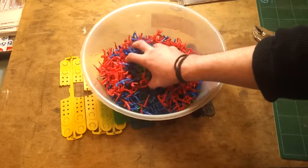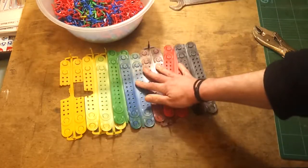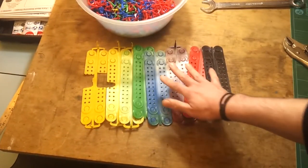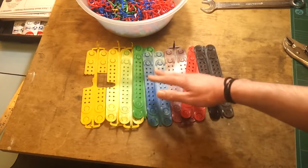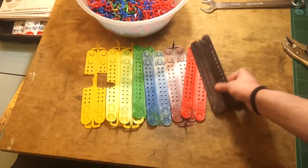These are all the sprues that I've chopped off — all of these — and down here on the floor I also have a bucket of all of the runners out of the centre. All of this lot now needs to go back into the granulator, which gives me an excuse to show you what's involved. Basically all of this lot will get munched up back into granules and can then be run into black.